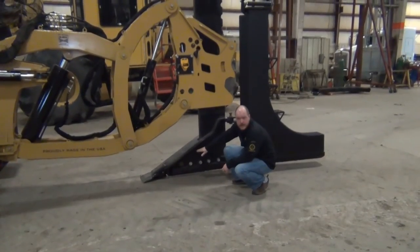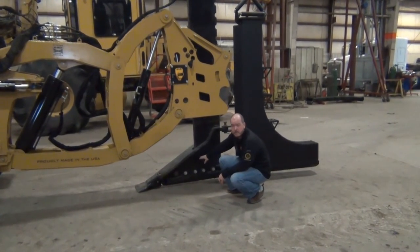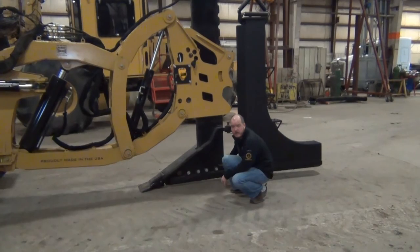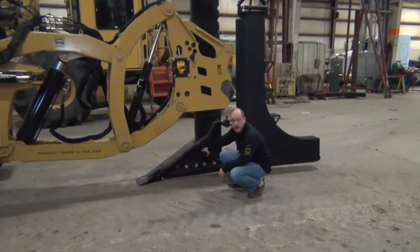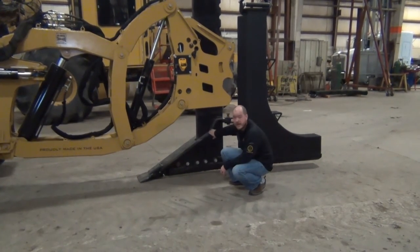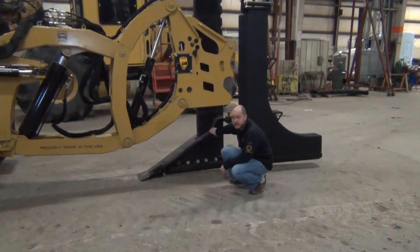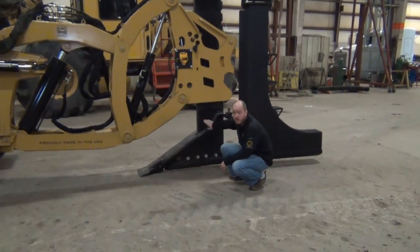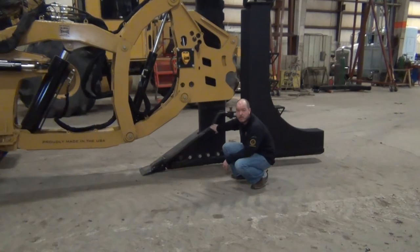I'd like to spend just a minute on the bottom of this shank and show you some features here. We have removable bottoms on the bottom of our shank — easy replacement. These and the bottom of our boxes are both made out of AR steel, so long life and great wear out of them. Eventually you're just going to unbolt, rebolt, and go right back to work. Each box has its own individual mold boards — these are not bad to change at all. By sizing each mold board to its individual box, we make sure that we're moving the dirt correctly, we get it out of the way for the box, and we minimize smearing. We make it pull a lot easier.